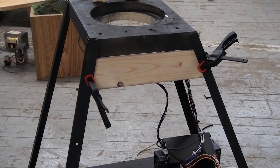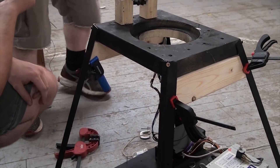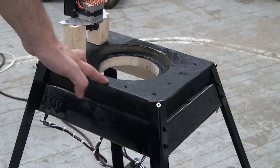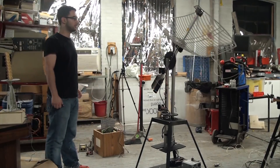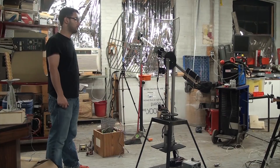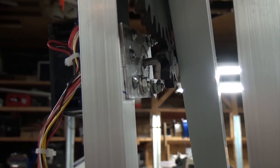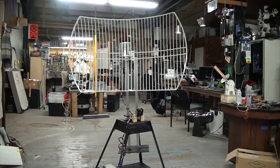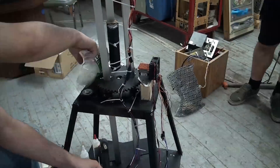But while we were tweaking everything, we noticed that the bearing track wasn't sitting quite level and was kind of wobbly. So four more braces were added by cutting some wood and removing one leg at a time to drill more holes in the steel. Once these were added, things were a lot more stable and level. Throughout this whole process, I talked a lot about what I call cascade fixing — every time you fix one thing, three others break that now need fixing. Some such fixes included having to reposition the upper stepper mounting plate to make the gears mesh better, or raising the whole upper assembly. By the end of Tuesday night, everything was finally working and the whole system was moving smoothly, so all the cables could be zip-tied into what will hopefully be their final resting place.